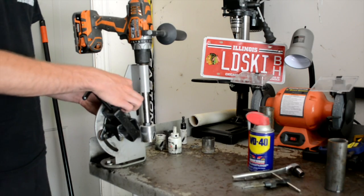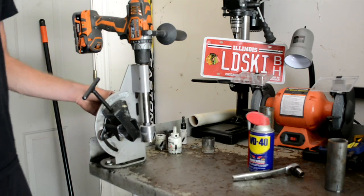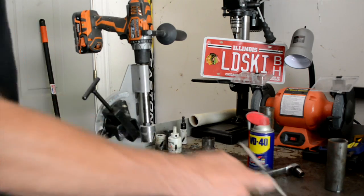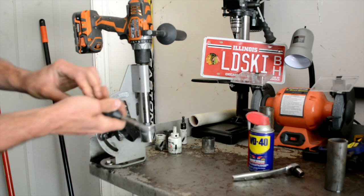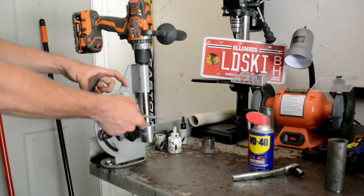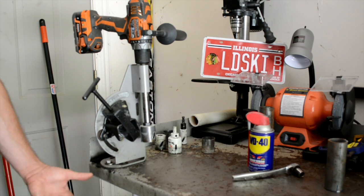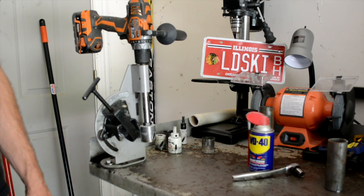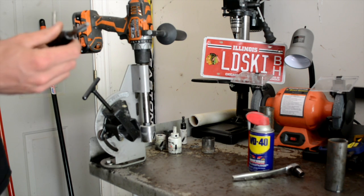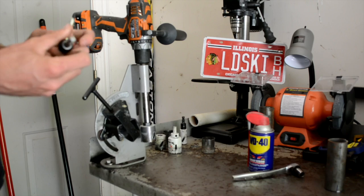So once you get the washers in, next thing you want to do is have a 5/16-24 thread tap around. The reason for this is that you're going to be loosening and tightening these bolts all the time to change the degrees when you're doing a cage or whatever it is. As you do that, the threads get worn out very easily, so I just like to re-tap it.